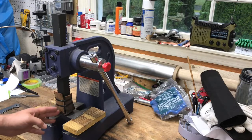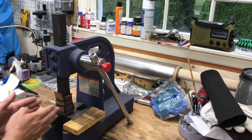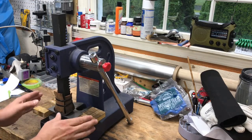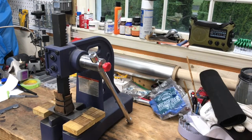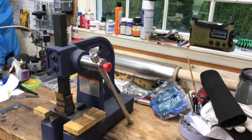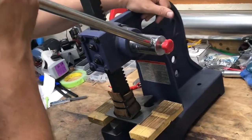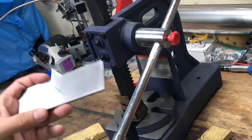Try to get your blade steel centered up both in and out and left and right. Try to make sure that the blocks are perpendicular. All we're going to do is just pull down about that much. Now we're going to go to the surface plate and check it for flat.